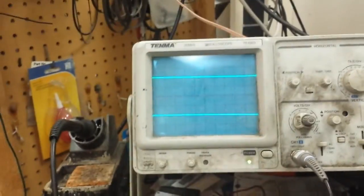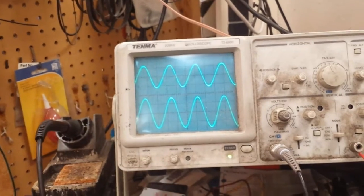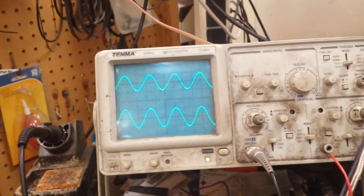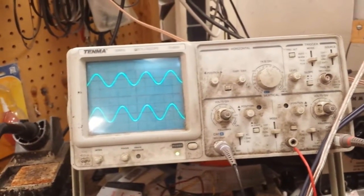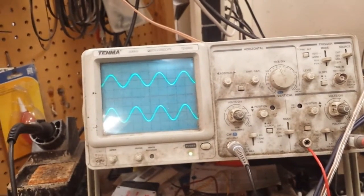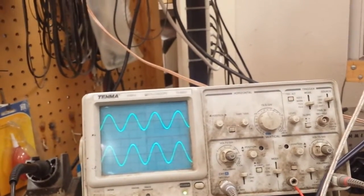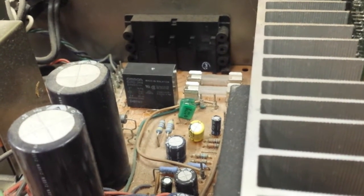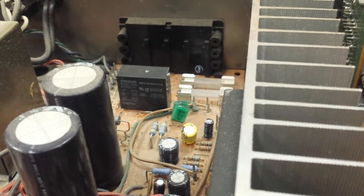We got a click - and we have sound. The low frequency extension buttons are a little twitchy; I'll have to take care of that one. Otherwise it looks good. Tapping on the relay and no jitter or anything. So there you have it - a nice beefy 8-amp relay in there where there used to be a 2-amp, and we made the corrections to the board necessary to make that relay run, because obviously just dropping it in doesn't work. In my haste I overlooked that.